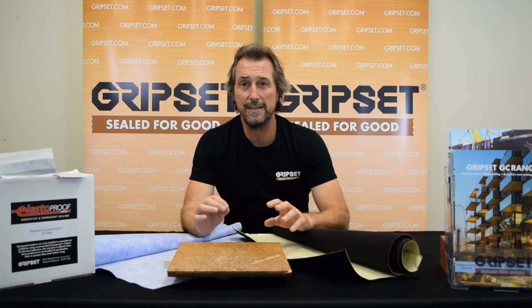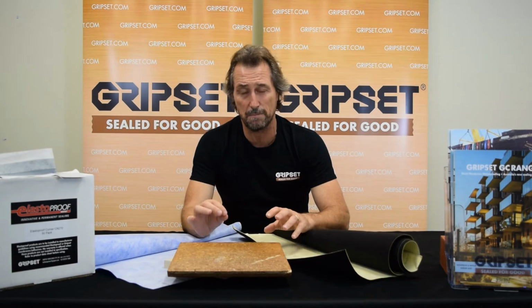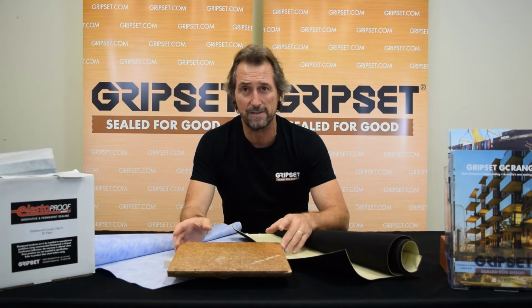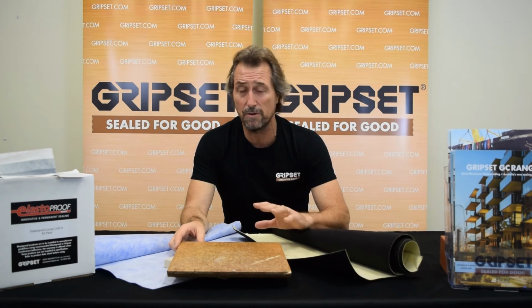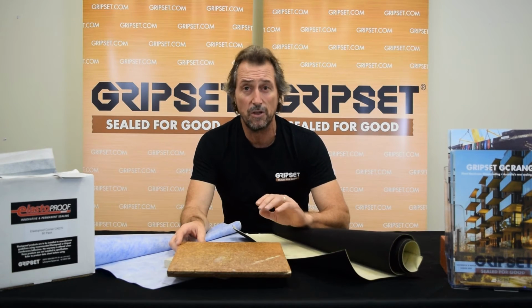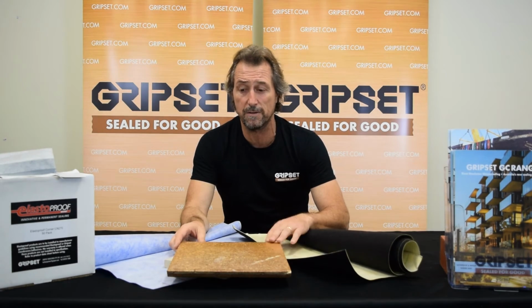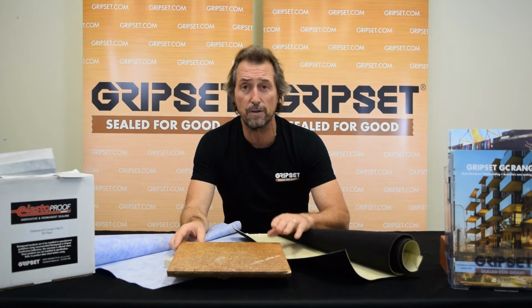If you are finding yourself challenged, you go to a building site and the client has timber on their balcony deck, it is red alert. Do not even think about what primer is going to work and what I should be doing. You need to make sure that there is absolutely no chance in hell you're going to waterproof or tile over that. If you do, be aware that all the risk is with you,